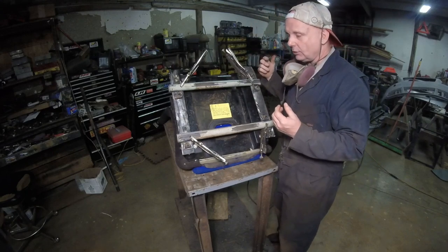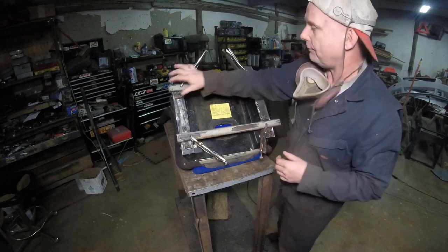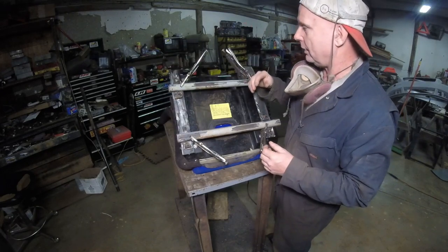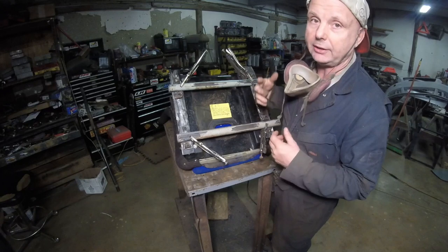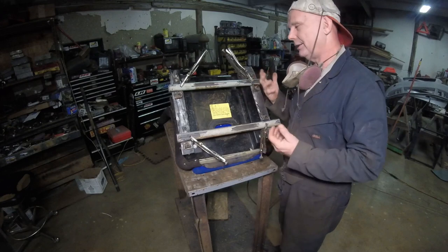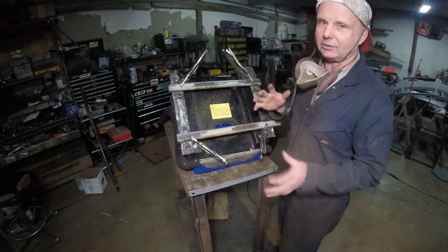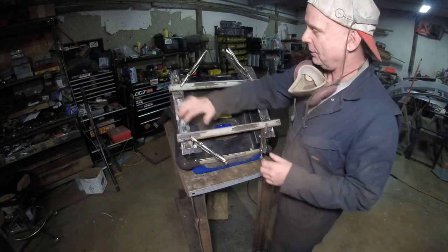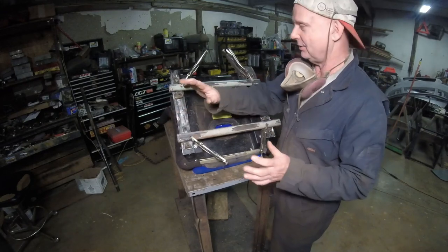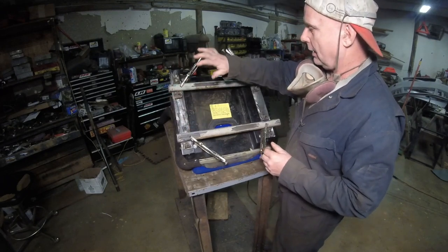So, all right, let me get the welder started up again so I can tack this in just so it doesn't go anywhere. And then I'll pull the seat. We can finish up the entire frame, with all the supports that go right down through here. And I think we can then pretty much reinstall it and figure out exactly how it's going to work in there. If there's going to be any difference, it's going to be half a centimeter, quarter of an inch at max, so it really doesn't come into play just in case something moves. I already figured out this is where it's going to go, this is going to be good. So, all right, let me get this stuff all squared away.